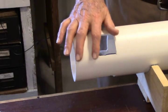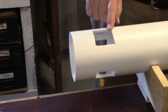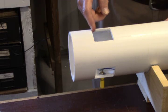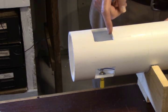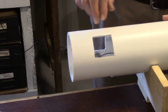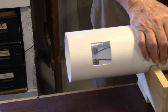To make the port cuts, at the corner of each square I drilled a one-quarter inch hole with my electric drill. Then I took my jigsaw, put it down into each one of those holes, and simply carved them out right around the square. A jigsaw with a very fine blade will go right through this stuff very quickly. When you're finished, take a wood rasp and file down the edges to get them nice and smooth.